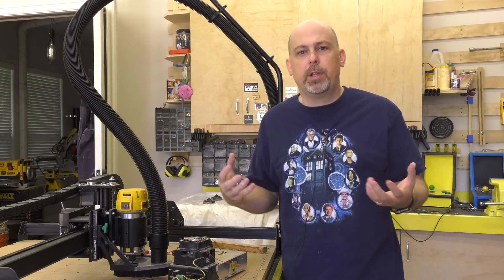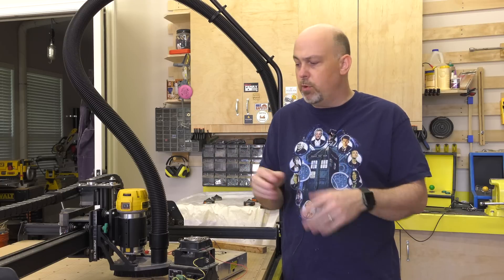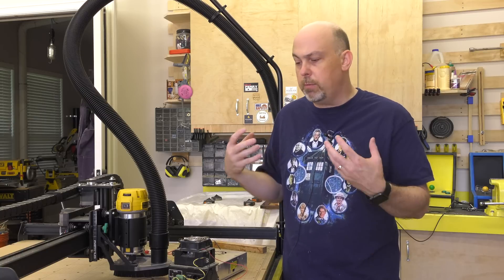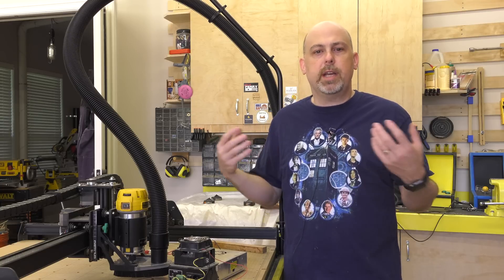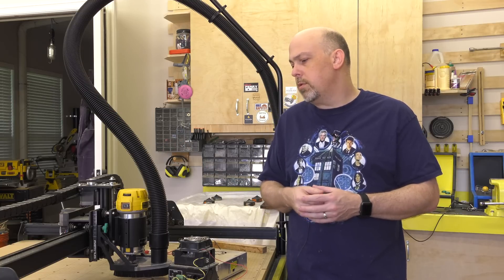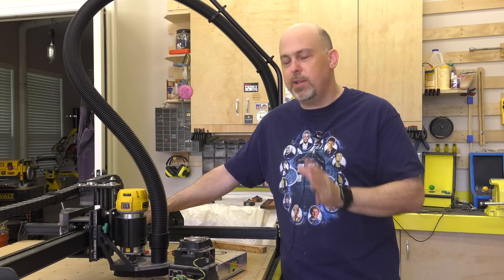There were a couple of other problems I found even more irritating. The gantry arm was made from two separate pieces of aluminum, which allowed a lot of flex when moving through tough material like walnut or aluminum. You'd end up with a shaky or stair-step pattern on the material, and I'd have to run the X-Carve so slow that a 10 or 15 minute carve would take two or three hours. With the new X-Carve, it's a single piece of aluminum that is much more rigid — a major upgrade.